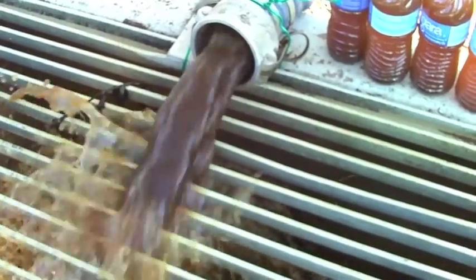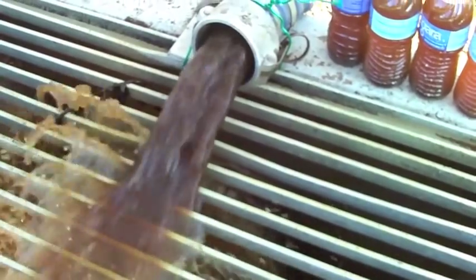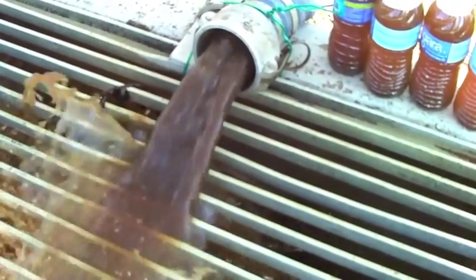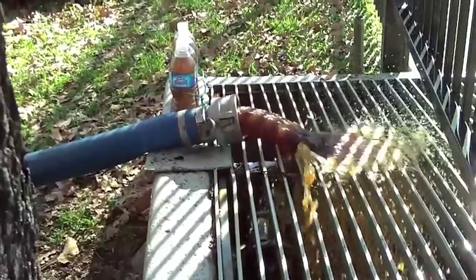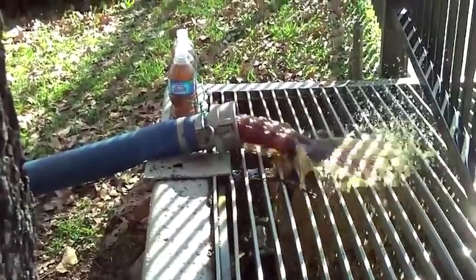This is a 1 million gallon elevated tank we're cleaning, and you can see that's not white sand. On the inside, the diver's in about 40 foot of water, and you can see the clean floor area he's cleaned, and a couple of inches of sediment is what he's working on getting out. Outside, this is what it looks like. You see my sample bottles I've filled up there.